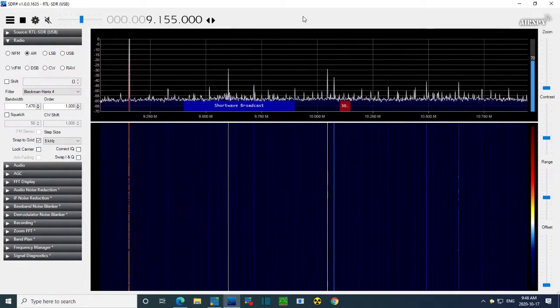Wow. Okay. Believe me when I say that is now an 8700 kilohertz signal. That's the local oscillator? Way the heck down there? The signal strength is enormous compared to every other signal. In decibels, it's going off the top, so it's probably 40, 50 dB above anything else, even more. It's huge. So this is why this band is not working.